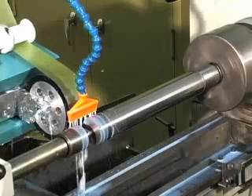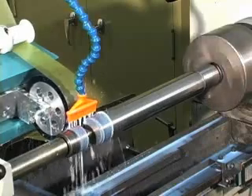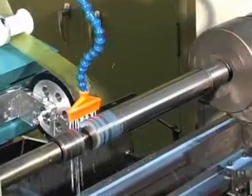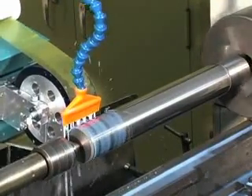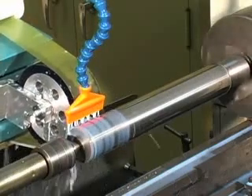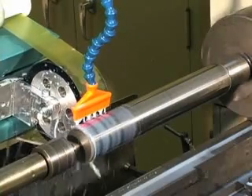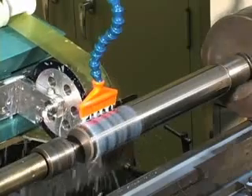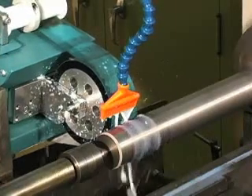Once the Super Finisher is set up and the traverse and speed are programmed into the lathe, simply turn on the Super Finisher and advance the contact wheel and activate the oscillation to begin the finishing process. Once the first pass is made with the contact wheel oscillating, the operator can examine the scratch pattern. If any straight scratches appear, the traverse rate should be slowed or a more aggressive abrasive used. The abrasive grit size is reduced in half for the next step. Alternate passes with and without oscillation with increasingly finer abrasives until the desired finish is achieved. No oscillation provides a contrasting linear scratch for determining if the previous scratch is gone.